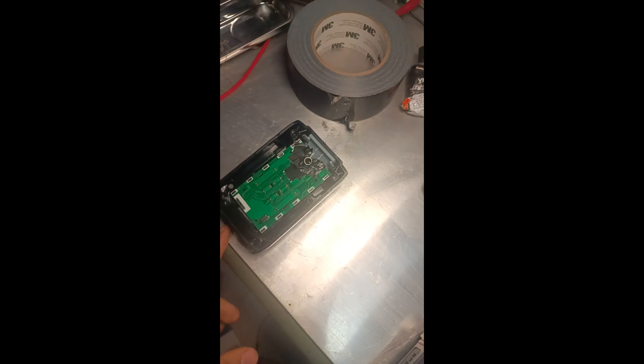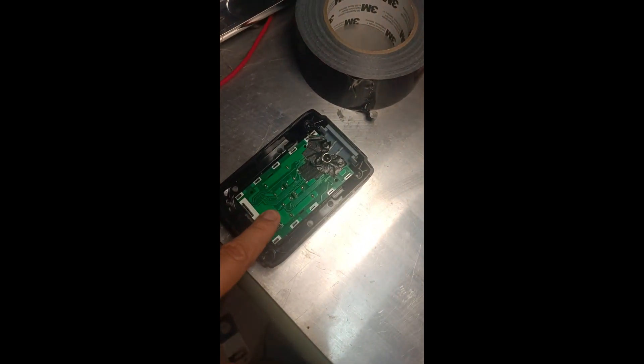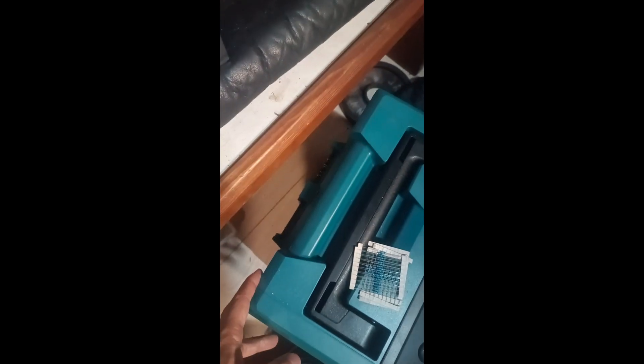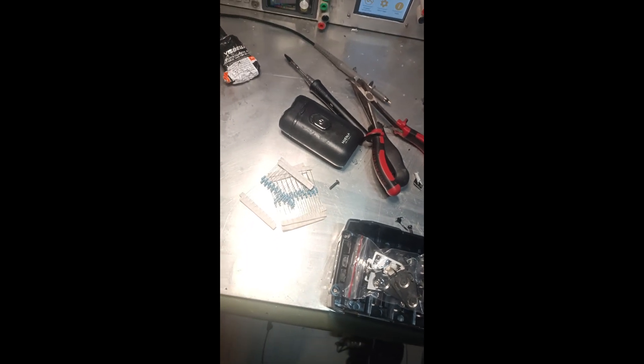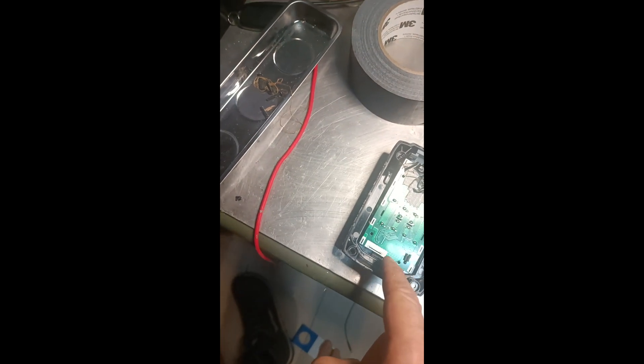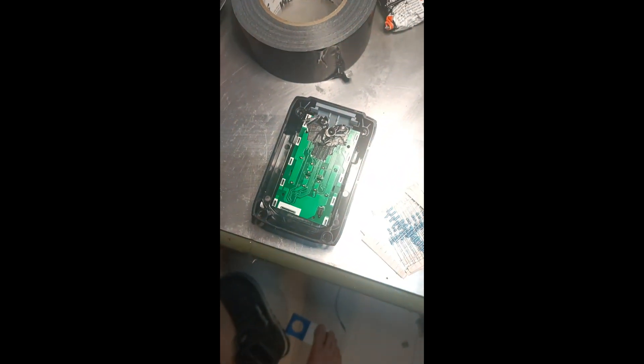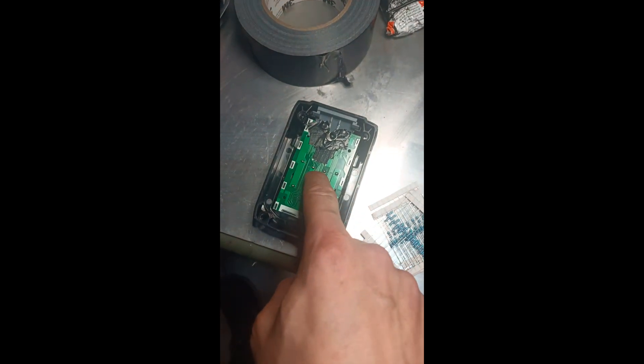What we have here is a Makita battery holder and a PCB from AliExpress for the Makita XGT series — the 40 volt system. We have a microwave here that only runs off 40 volt batteries, and a bunch of resistors. Since I only have 20 volt batteries, I'm going to replace each of these batteries with a resistor and wire this up externally to have some voltage going to it, and then this AliExpress PCB should handle all the communication to run off any other Makita battery.